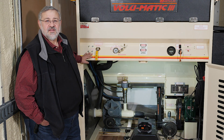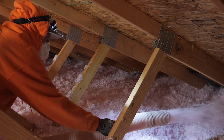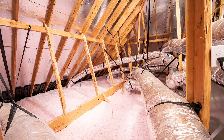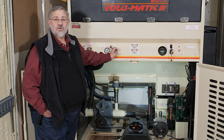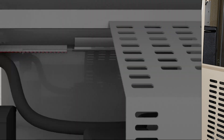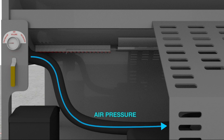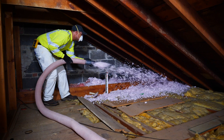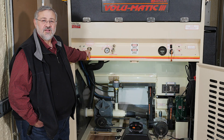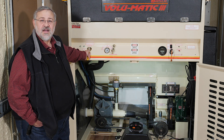We have developed a set of baseline settings as starting points for installing ProPink L77 loose fill insulation in attic applications. The slide gate should be three-quarters open — on the common 18-inch gate, that would be between 13 and 14 inches. Close the air bypass completely so all of the air is going through the system. When properly adjusted, the insulation should bloom and extend a minimum of 10 to 12 feet from the end of the hose. All machines with adjustable transmissions should start out in third gear; you may need to shift to fourth gear to operate at higher speed.